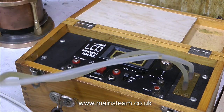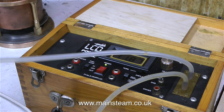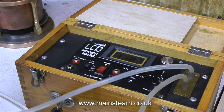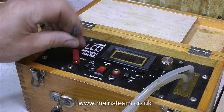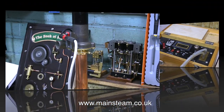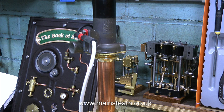This is something I put together quite a few years ago when I used to fly model aircraft. It's a power panel in a nice little wooden box with a battery underneath it. It also has a fuel pump, and I'm going to use the fuel pump to pump some water into the boiler. I'm plugging the blower into the 12 volt starter sockets. It's a nice portable power pack, so I'm not reliant on mains — I can start the boiler anywhere I like.